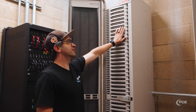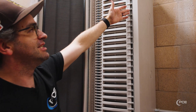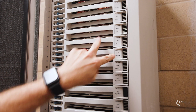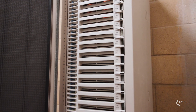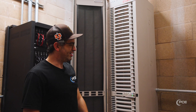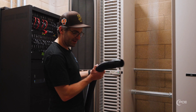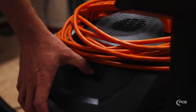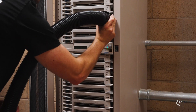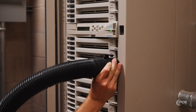The other option you can look forward to doing once a year is also sucking out the dust that accumulates in the heat dissipation fins on the side of each dimmer card. The easiest way to do this is to set up a vacuum and just take your hose and suck it out going from top to bottom. With your vacuum set up, kick it on and drag the hose down the side slowly, sucking out as much as you can.